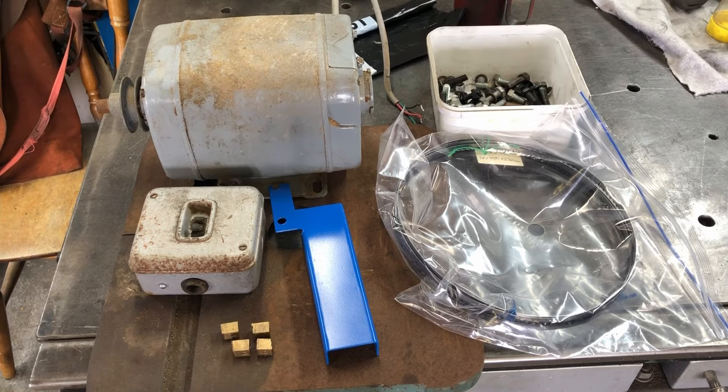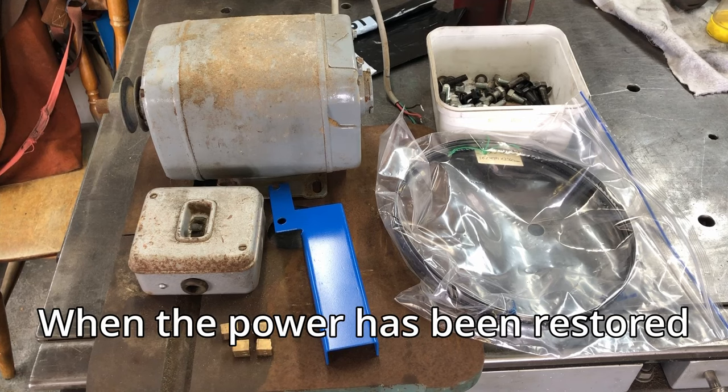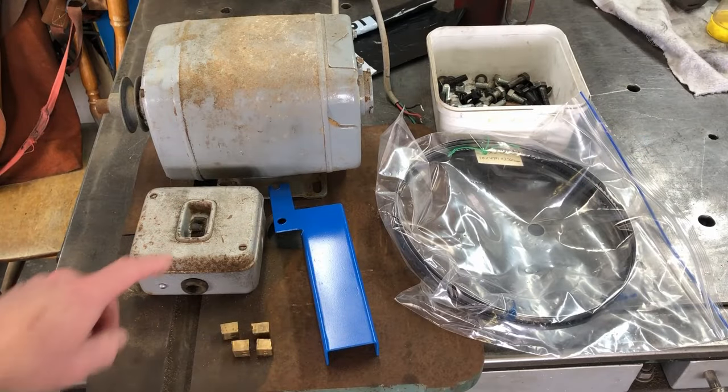In summary, we're going to put the motor in the bottom of the lower cabinet, and I want to add a zero volt release switch — a safety switch that stops the bandsaw starting up if there was an event where the power failed and came back on. Those switches have electromagnet components and when the power is cut, that magnet stops working and the switch needs to be manually activated again. That switch is going to take the place of this old switch here, mounted halfway up in a more convenient place.